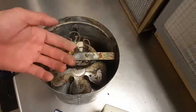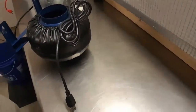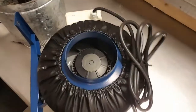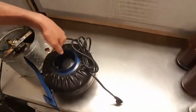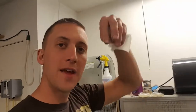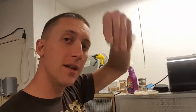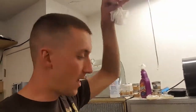It's just gooey wet junk. As long as it's wet and not dried up and caked on, you can just shoot your hose gun through and it'll rinse out the back end. Ideally, if you're exhausting up out the roof, you'd have the exhaust fan mounted in a downward position with a p-trap and a clean-out at the bottom that you can remove, hose out, and clean the fan — that would be the best situation.